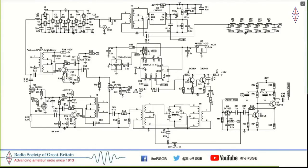I decided to switch from a crystal to a TCXO after looking at Hans's QDX design. And I said, man, this is so simple and brilliant to just use TCXOs. They aren't very costly at all. They're just less than a dollar now. It just doesn't make sense to not use a TCXO as the base of your radio. So this is the entire radio, really simple.